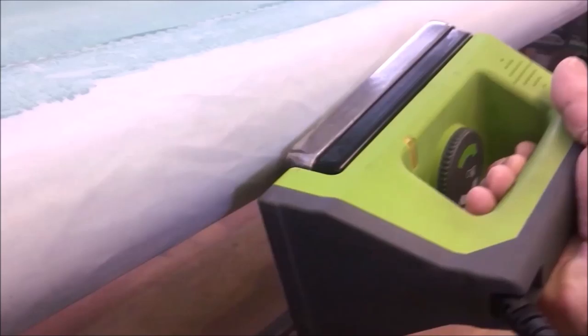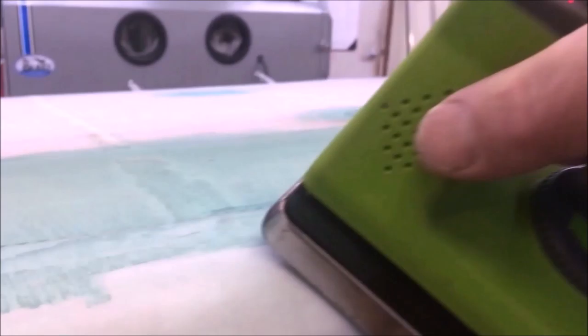And if you watch, you'll see, it's kind of hard holding the iron and doing the shrink here. I don't want to go right over to the edge. But what we're after is that nice, hard, perfect leading edge. You can see right exactly where I stopped. This is unironed. This is just ironed at 250 or 260. We're going to come back and sneak up on it. We're going to want to take it all the way up to 300, but we'll take it up nice and slow.